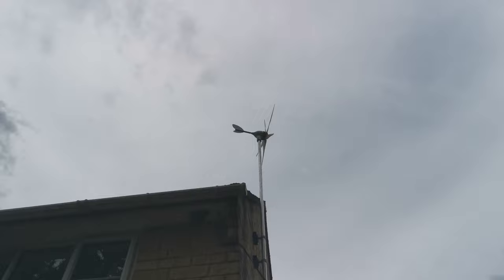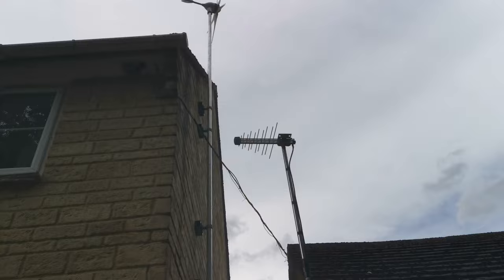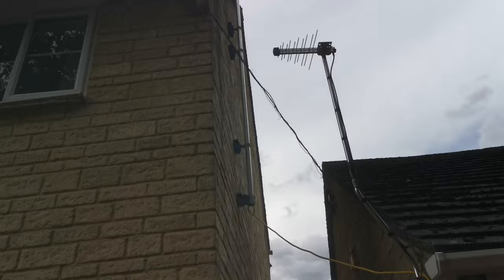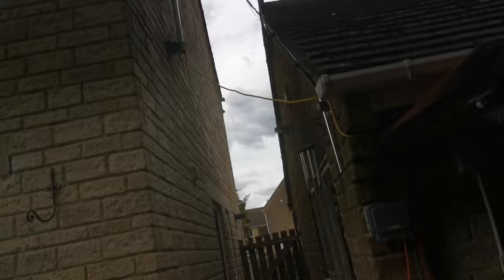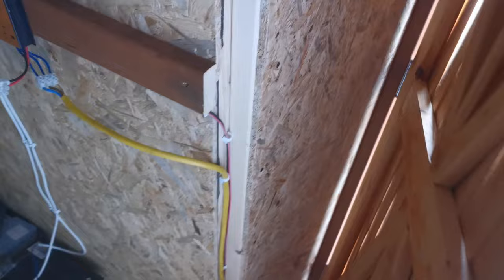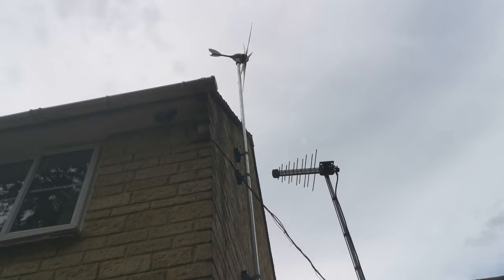This is going to conclude the video. We've had the windmill installed for a couple of days now — the pole has held up really well and the brackets have worked just as intended. We thought we might have a vibration issue inside but so far we don't. We haven't had much wind since installation, but we've had enough to see what it's doing. The maximum we've seen is 55 watts and we've done 0.3 amp-hours — not a lot, but better than nothing. The solar has been working really well too. Thanks for watching, I'll see you next Tuesday.